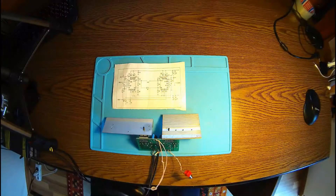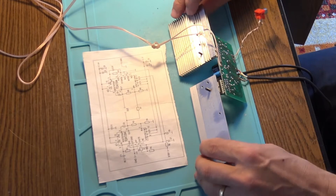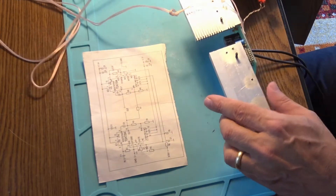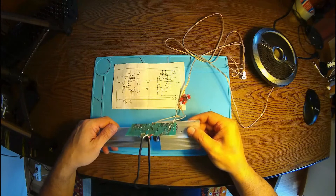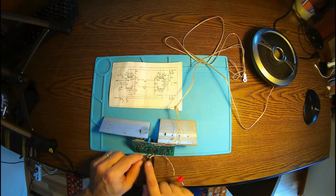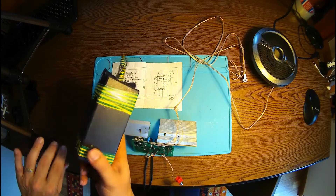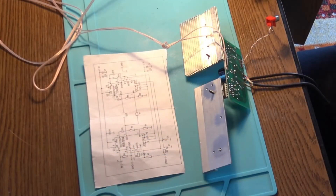So far, we have the loudspeaker plugged in. I just planted two small cooling sinks. They are not touching together because there is no isolation yet, and all the connections are okay. We have the plus and the minus. If you remember, we had this differential plus-minus 19 volts power supply.